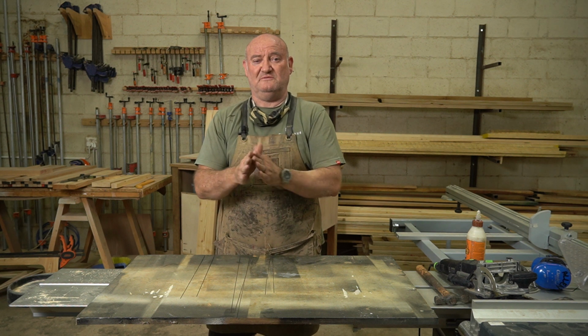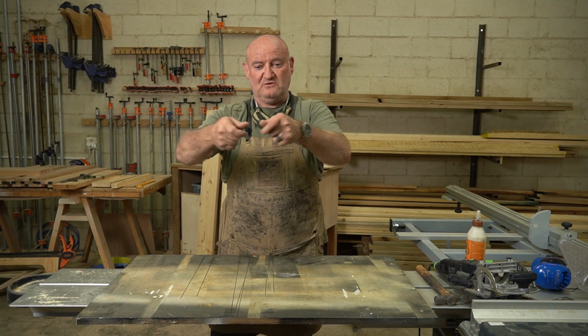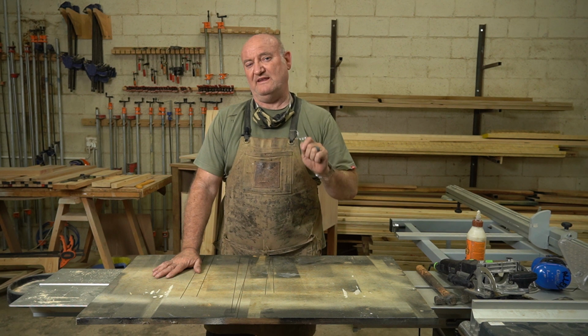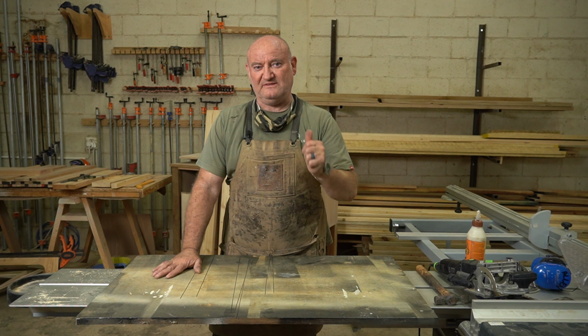Once we have those thin strips, we're going to put those on top of a piece of plywood to make a top. We're going to use solid wood for edging. So we're going to have this really sexy top, but it's going to have this little secret, and it's going to be able to stay straight and flat for all time. Okay, so let's get cracking.